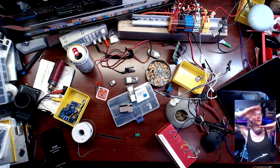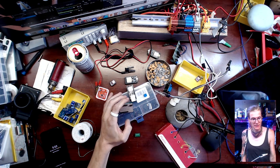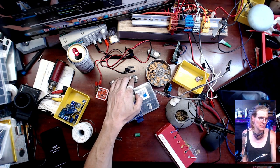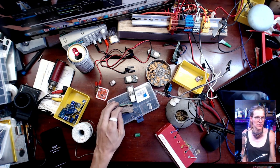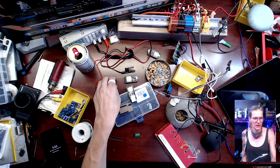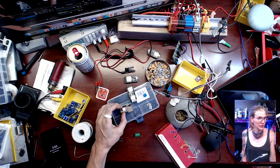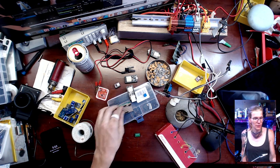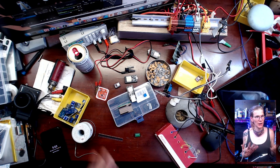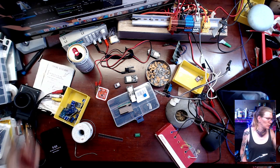That will be motorized with a beefier stepper motor, and the PWM, direction and sleep pins are all going to one spot. So in that circumstance, instead of having the motor controller on top, you'd have three pins coming out and going to an external motor controller that will power the bigger motor, the beefier motor controller.